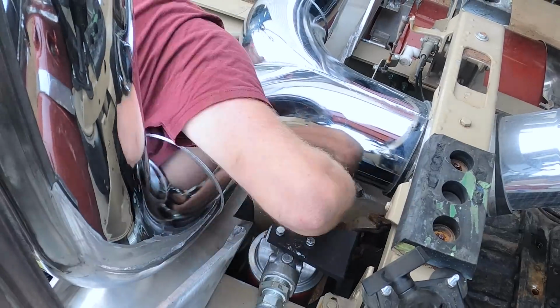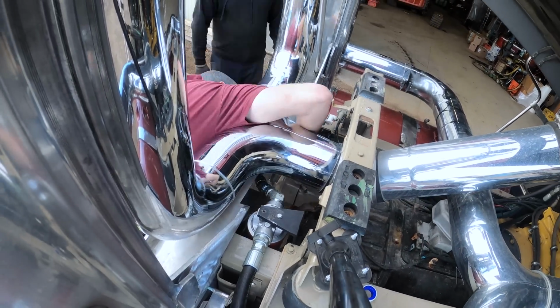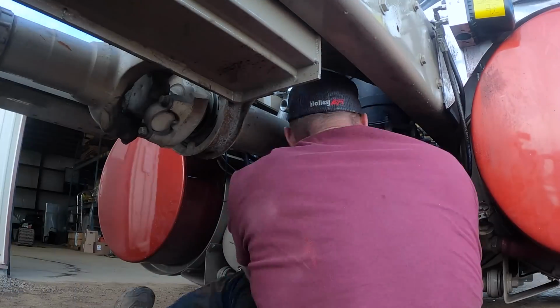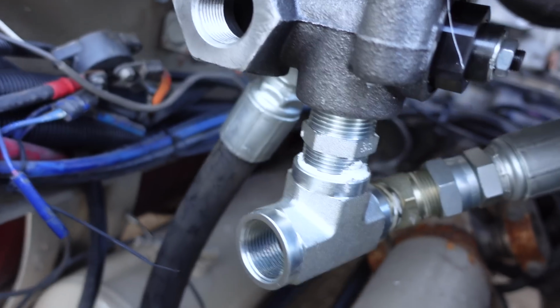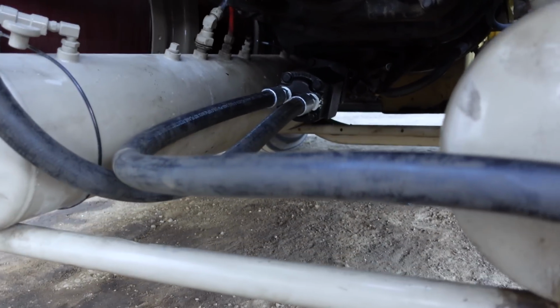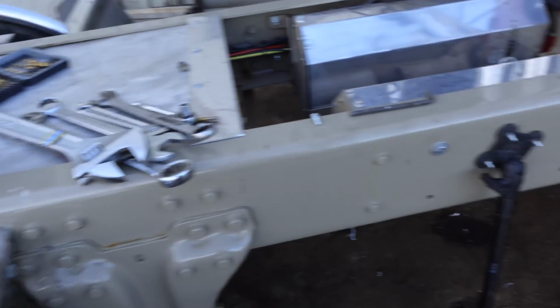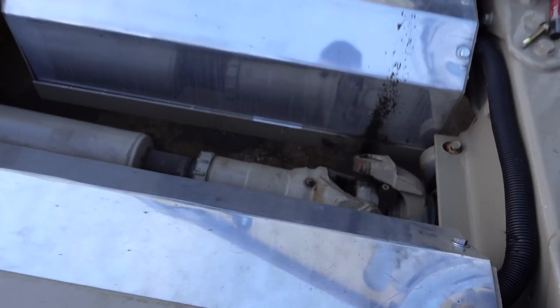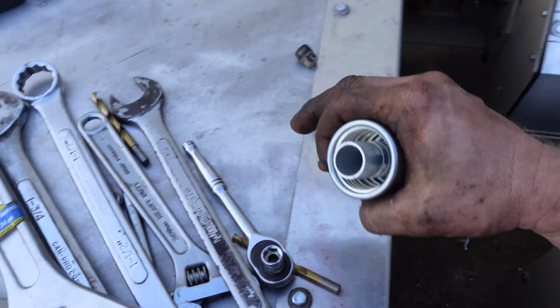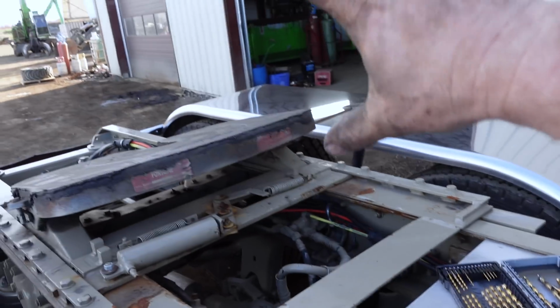After this, it's just pressure line and the tree. Oh yeah, okay. Okay, so the relief is right there. It goes over to the filter right there. Filter into the tank. Everything looks pretty good. I'm gonna tie those two hoses up, make a nice little bracket that goes to the fuel tank mount, so those will be nice and secure. Now these lines, I think what we're gonna do is take the lines and try to sneak them through the frame here behind the battery box, and then come up here into the trailer, and then hook up to the trailer. We'll put that nice deck on there later, and put a nice angle on it. We'll cut the hoses then, and put quick couplers here, and then quick couplers for everything. So all my hoses and everything will be hidden. But for now, we're just gonna leave them and run them so that we can run the trailer.